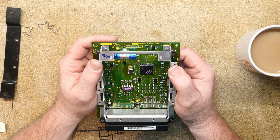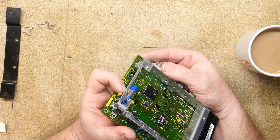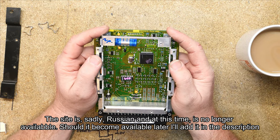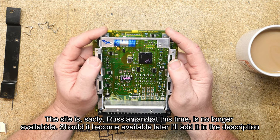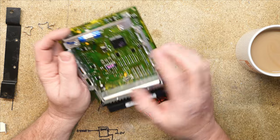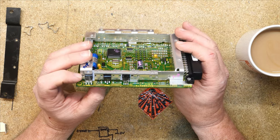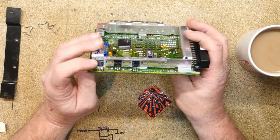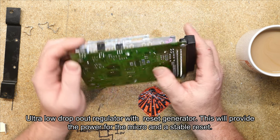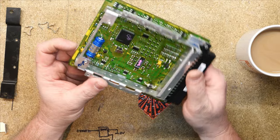We have a Motorola logo ZC99229 CFN running at 4 MHz. Someone has already done a replacement control module based on an Arduino, and certainly that chip running at 4 MHz is well within the scope of an 8 or 16 MHz Arduino. I want to say there's a switching-type regulator here — an L4947 — it rings a bell. It definitely looks like it's involved in power supply.